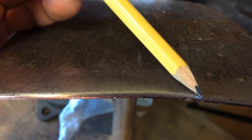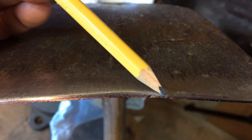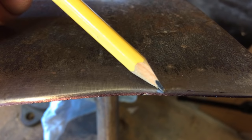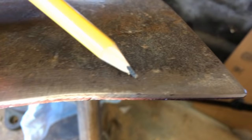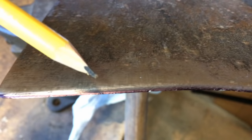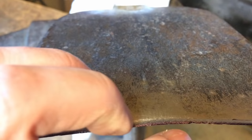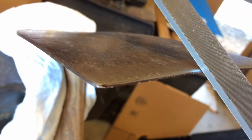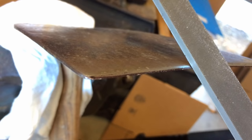A great thing about filing is the feedback. You're going to see metal shavings and feel and hear it when you're actually removing metal — if you don't push down hard enough the file just slides across. Looking at the Sharpie close up after the first round of filing, I've removed metal from the top part of the bevel, but the black Sharpie still remaining tells me I haven't actually reached the cutting edge yet. Without the Sharpie, you can look for the shiny new metal revealed when you file. To reach the cutting edge you can either continue at the same angle until the bevel widens enough, or drop your hand slightly to hit that cutting edge more quickly.